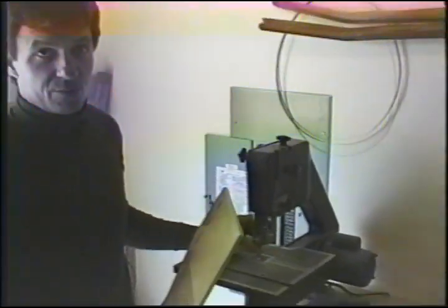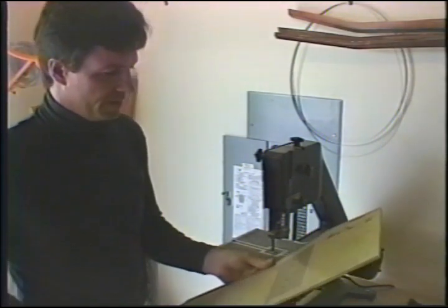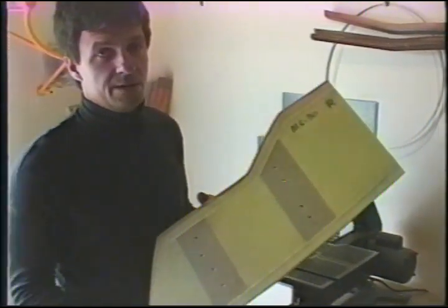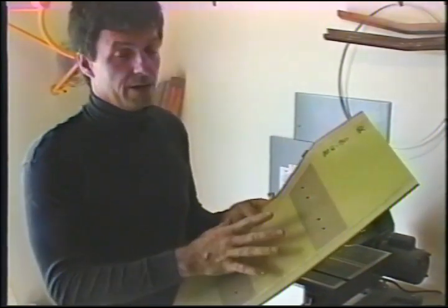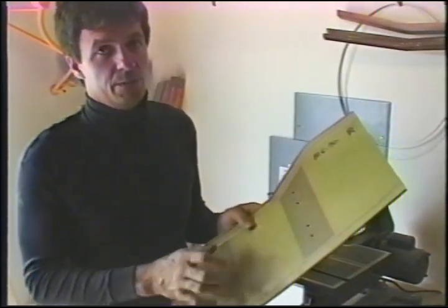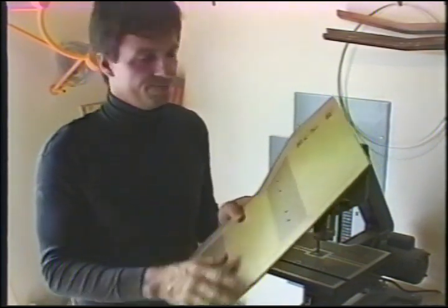You've heard of the theory: measure with micrometer, mark with chalk, cut with axe. Well, reverse the idiom. Measure with micrometer, mark with scribe, cut with ultra thin blade with ultra caution. Keep them the same. These were templated for a purpose, to control the assembly process and the fit. Maintain your accuracy here, and everything will go together, and you'll end up with a gear installation that will be surprisingly simple and easy. Thank you.